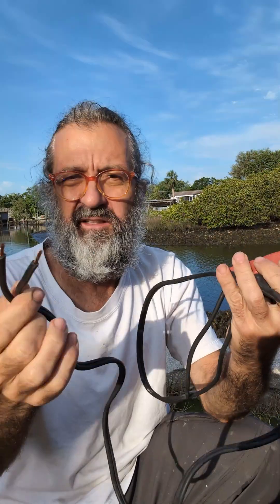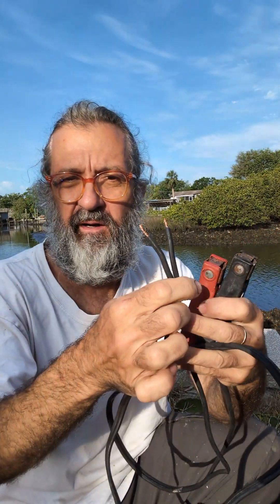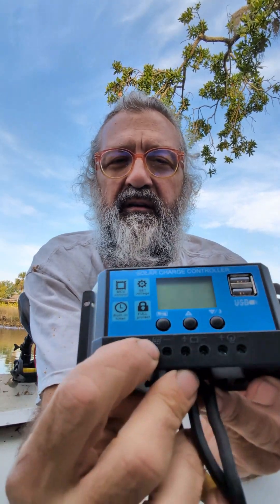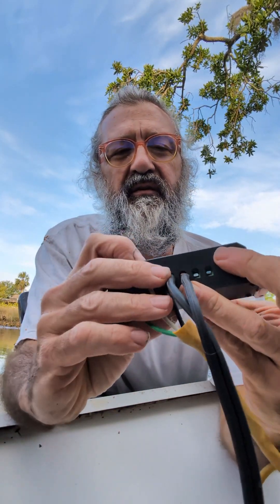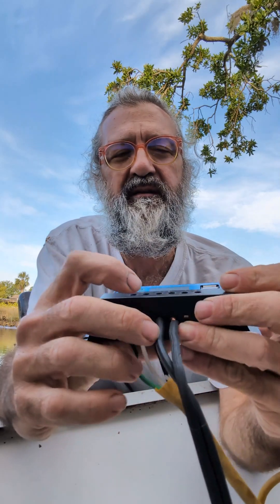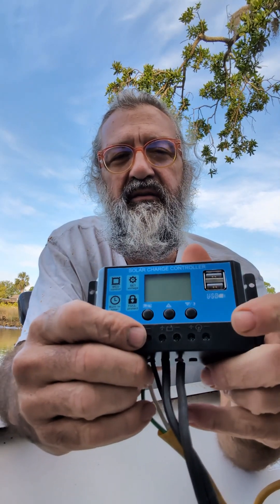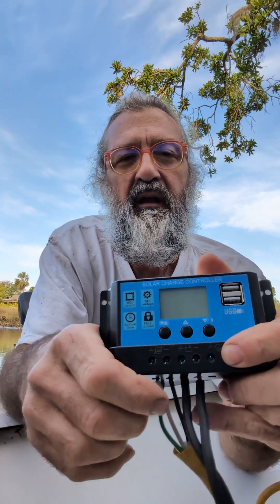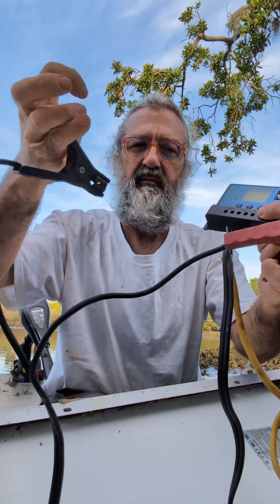You need some clamps — you probably have those laying around. Now we need to connect them. Make sure you put the positive and negative in the right spots. It says here solar panel with plus and minus, then battery plus and minus, and this terminal is for the load, which I rarely use but it can be useful if you want some lights at night or anything.